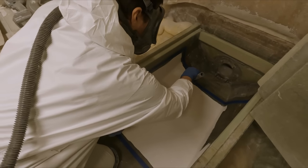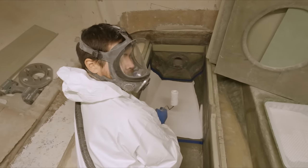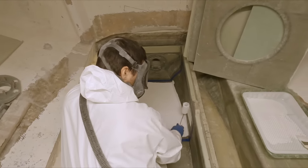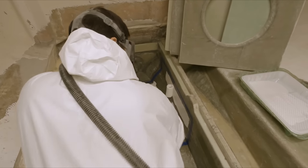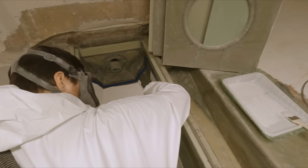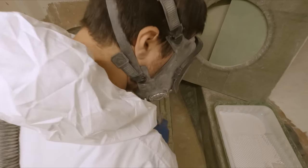So thankfully, unlike paint, if you lay your gel coat down thick, you don't have to worry about it being gobby under a thick coat. It just cures through the catalyst, and you come back over it again. Okay, that looks pretty good back here.